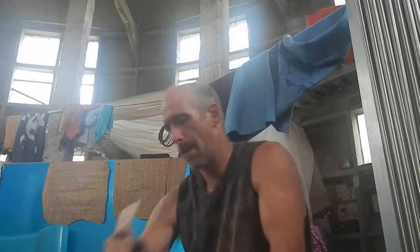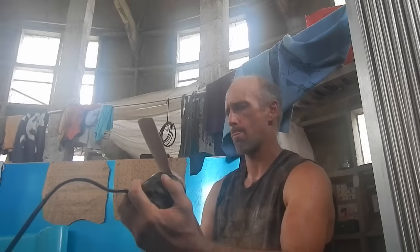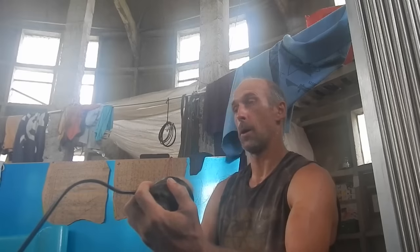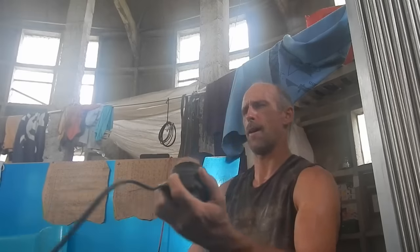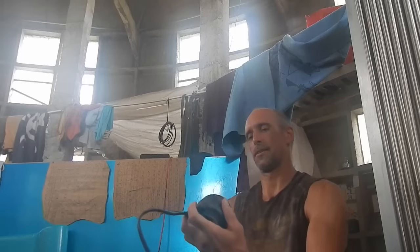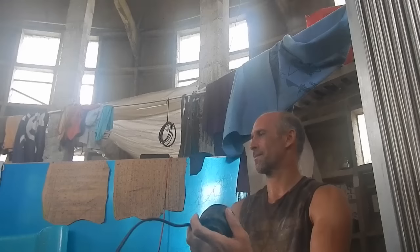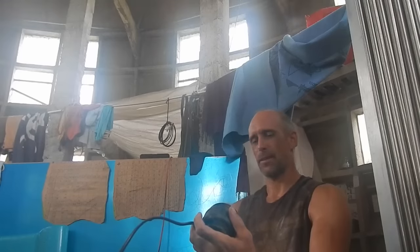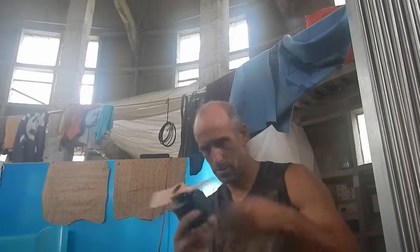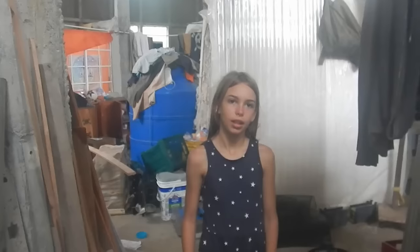Not bad. Can you plug that in? I didn't balance this propeller, so I was a bit worried. Whoa, that is a lot more wind! It is definitely - oh, nice. Alright, unplug it. It's definitely wobbling a little bit, so I want to get the propeller balanced better. Man, that is way more wind than before. How are we going to balance the propeller? I don't know yet. Stick a drill bit in there and let's see - that propeller blade down there is heavier than the other one. Yup, definitely heavier, so I have to file down that one.